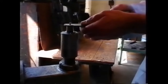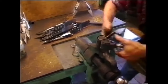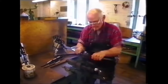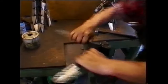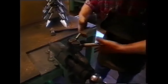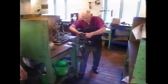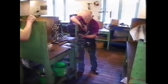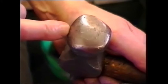Here a bender is riveting the double bow together. Here the bender is forming the bow — we call this pulling round. Depending on what type of shear they are, some are stiffer than others to pull round, so consequently he has a hammer at his side if he needs it. If they need a bit of persuasion, like this one, he's going to give it them. That shows you how much weight the hammer has taken — it's taken years to get like that.